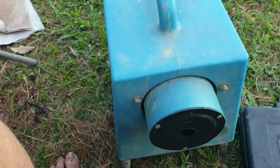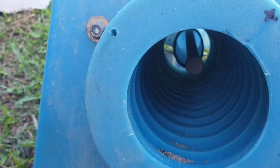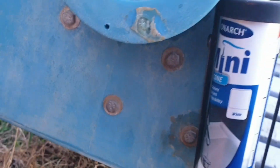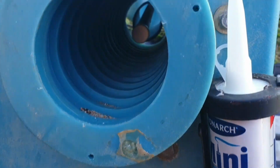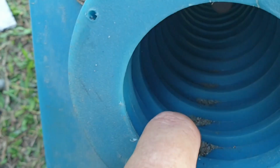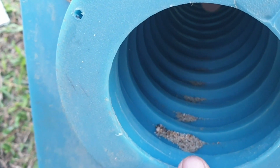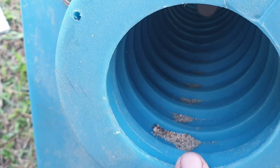Back again. You can see those runs that run right up the machine. There's the feed and the spray bar. And you can see I'm reducing it by a lot, probably over half. You can angle it whatever angle you want, so you can feed it stuff like this and a bit bigger rocks than that. I'm only going to screen to about three quarters of an inch when I feed through it.